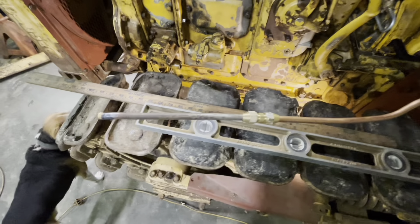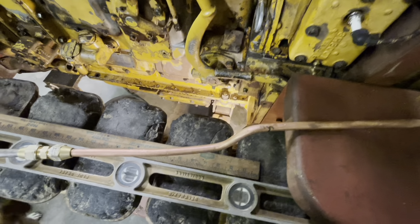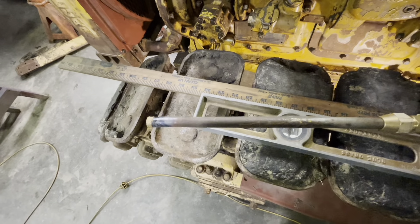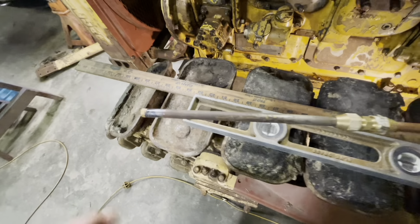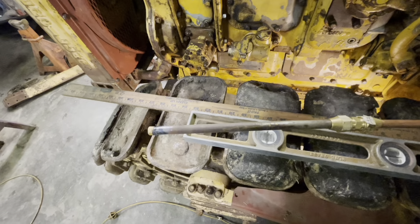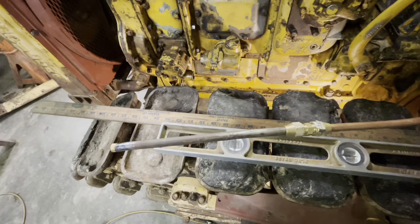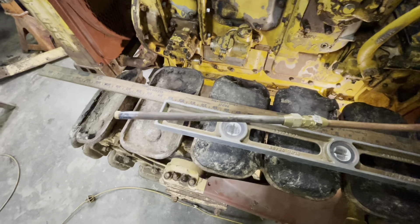This is my temporary gas line for the fuel line so I can get the tractor started and drive it around and have a little fun with it. But this is soft copper, which is not a good thing to make a gas line out of. Now hard copper — well, that's a step in the right direction. I'd really like to have some steel line like this here, but for whatever reason I cannot find straight half-inch diameter steel line anywhere — not at a hardware store, a steel place. What I have is a hard copper line.